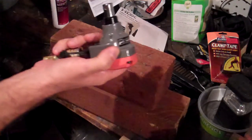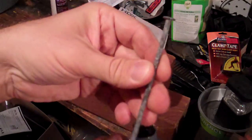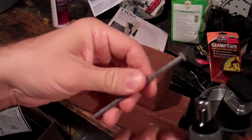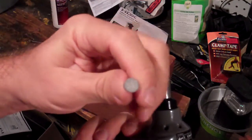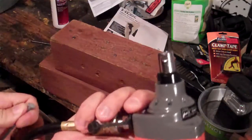I do have this nail over here, and this nail is a 4-inch nail, which you should be able to drive. But in fact, this nail's head does not fit into the nailer, so I wouldn't be able to drive this. Just something to be aware of if you're doing deck work or really heavy-duty framing where you use a lot of 3½-inch nails — some of them are going to have larger heads and you're not going to be able to drive them. That's probably the one limitation, I would say.